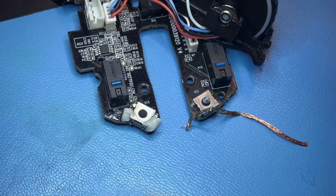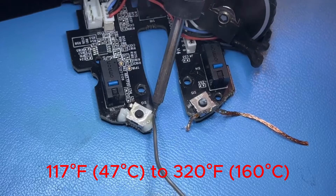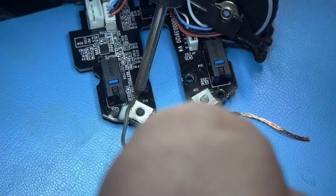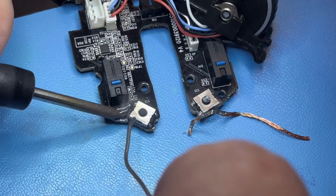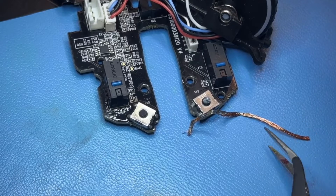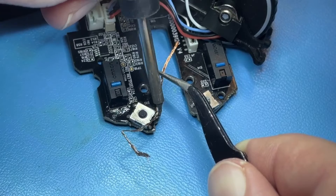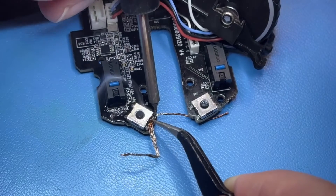I add a little more flux and bring out the big guns — some low melt solder. It melts at a lower temperature than regular solder; I'll post the exact figure on screen. I go ahead and solder the joints like you would with normal solder, and what this does is mix with the original solder that's there and make it a lot easier to remove the button. I hit all four joints, leaving a bit more heat on the ground pad where the original solder wasn't melting well. Then I wick up the low melt solder, hoping it takes the remnants of the other solder with it.